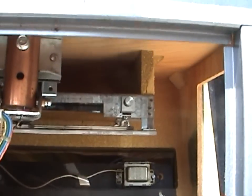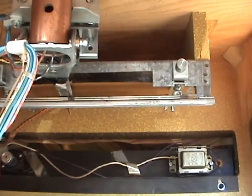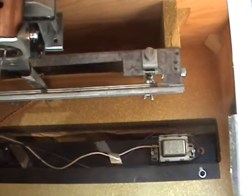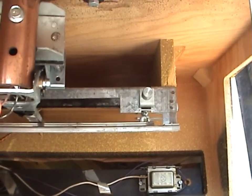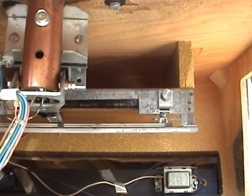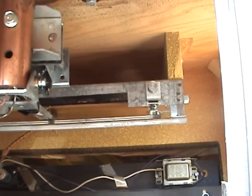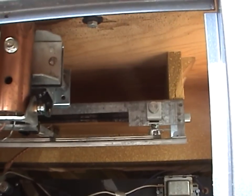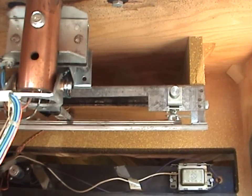If we look in here we can see the end of the rifle arm on its pivot, and there's a stylus on the end of that. The stylus makes contact on a disc — like a printed circuit board with copper pads — and depending on where the gun is aimed, that stylus will touch the correct pad. If it lines up with the exact same position as a similar contact disc in the back of the game, there's one for each animal and each target, and you pull the trigger, a score is registered.